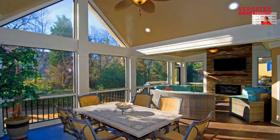We had a couple LVLs in here on this particular beam where we had a ridge, a gable and shed porch combination, and just to carry the load, we used a heavier LVL. So we could have gone with a 15-inch, but I think we just ended up going with something a little less and just did a running joint with the trim profile.